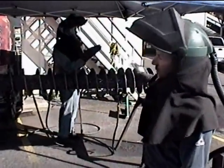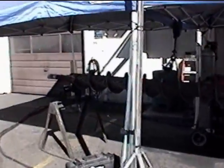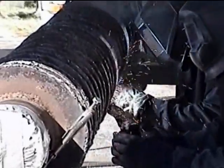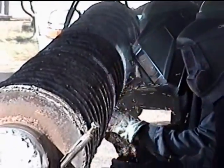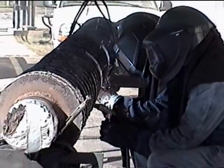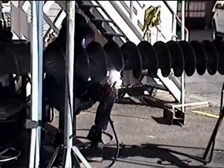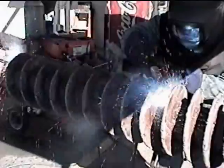Right now we've just gotten done with the OD of the auger and we're getting ready to start working on the plating and the tube. As we know with hard facing, they always go with the second layer because it's always going to be harder — we're not diluting into the base metal. That's why we build up and then put a cap on it so it's as hard as possible. The Washington 250 HT and 700 HT are the very best and most economical wires to do these augers.